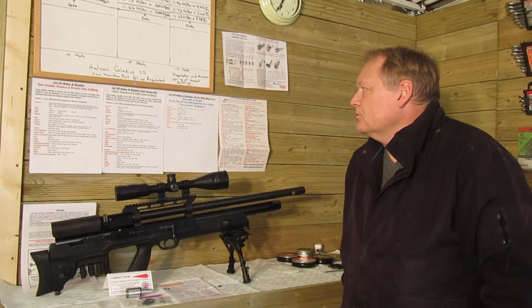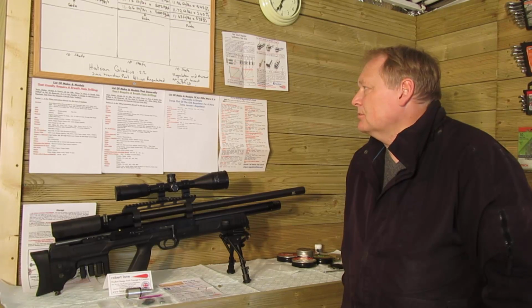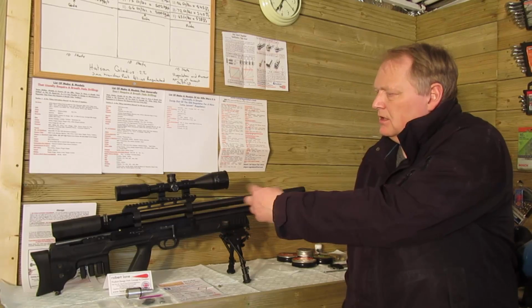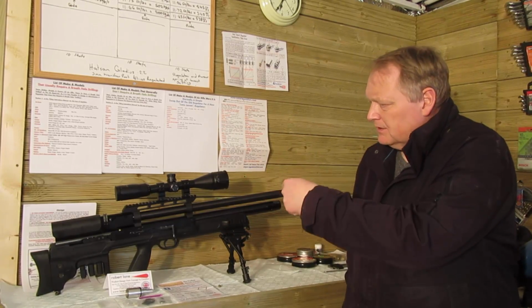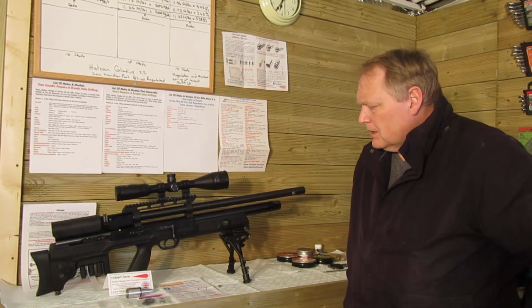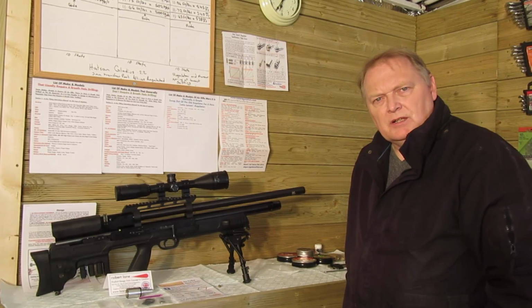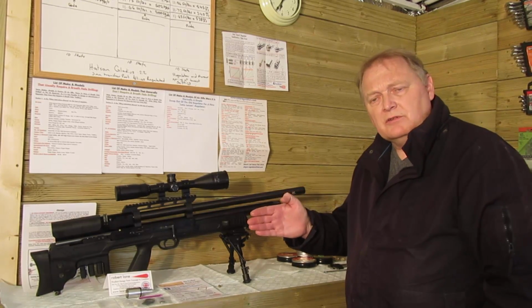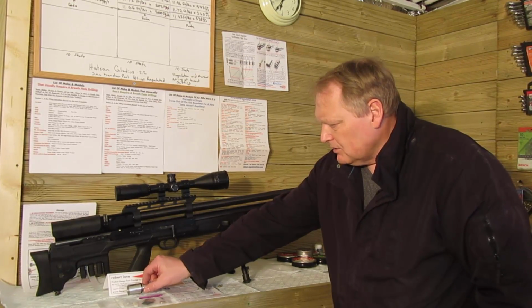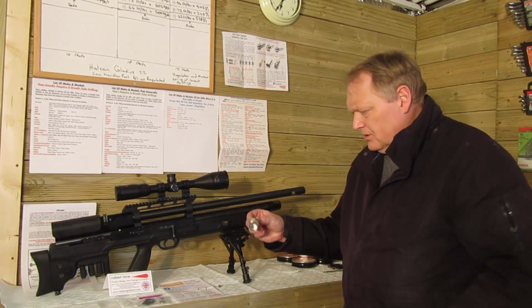And it says many makes and models of air rifle do not have to have a breathe hole drilled in the reservoir. All you have to do typically when fitting these regulators is to remove the reservoir end cap O-ring seal, which is there if you've got a removable cylinder. When you take the exhaust valve out, there's a little O-ring there that stops anything leaking out. So you remove that seal, and you can modify the actual valve a bit by cutting a groove through the actual threads.